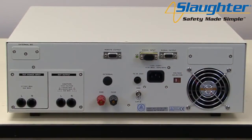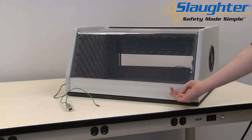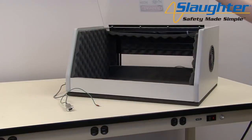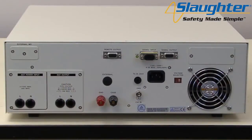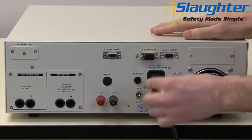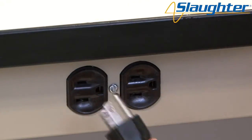The tester will not output voltage unless this interlock key is properly plugged into the signal input. This allows the user to wire pins 4 and 5 up to the doors of a DUT enclosure for an extra measure of operator safety. A DUT enclosure provides a means of positive protection for the test operator. Connect the power input plug into its socket on the rear panel of the tester, then connect the male end of the plug to the outlet receptacle.